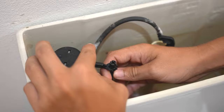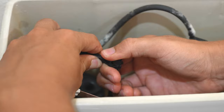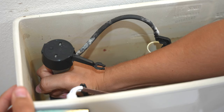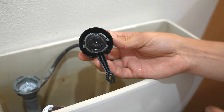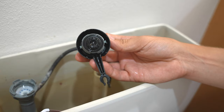This is the adjusting screw to adjust the water level — how full you want the tank to get. You just literally pull it right out, and that snaps out. Then you grab the pipe underneath the cap, hold it in place, and twist the cap counter-clockwise just a little bit. You should be able to just pull it right off. Here's the little seal that we need to replace — hopefully that's all that's causing the leak. Otherwise I'll have to get a new fill valve, and I'll be showing you how to replace the fill valve as well.